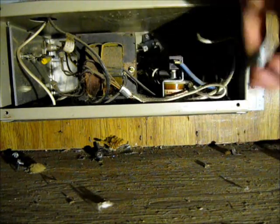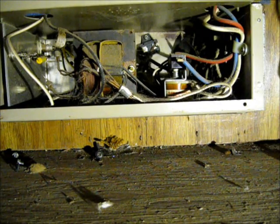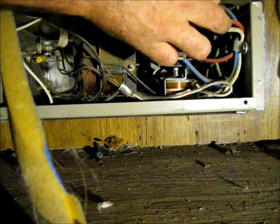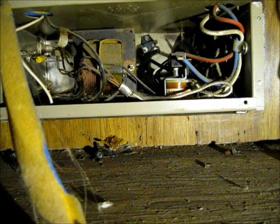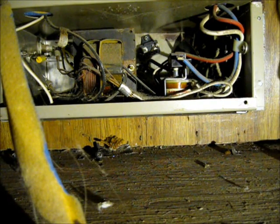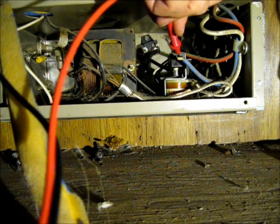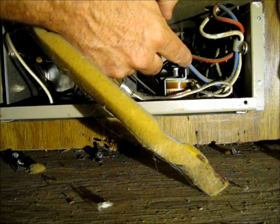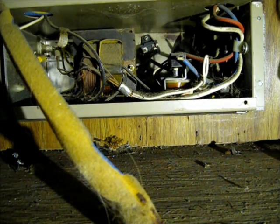Hopefully this whole unit should slide out without disturbing my wires. I've got some main DC lines coming in that will have to disconnect from here. Blue is your main positive to your fuses — that's going to be hot. Let me check it with the meter. Yes, blue is hot. You've got to be careful with that wire. Red looks like it's on the other side and is probably hot too. White is probably your ground — white is the main ground up inside there.